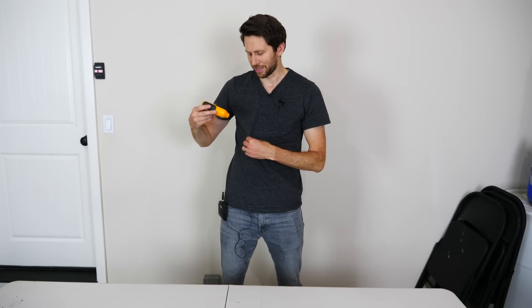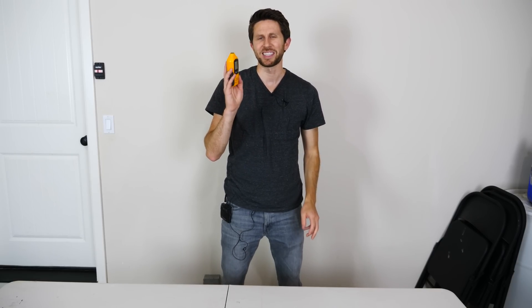Another thing to put your mind at ease — remember we were going to overload when I was using Siri? Let me show you something else that puts the microwave leak detector in overload. So all I'm doing is waving my shirt here and it's going into overload — over 10 milliwatts per centimeter squared. Where are those microwaves coming from? By waving my shirt I have a little static electricity on it, and those tiny micro sparks give off different frequencies of radiation that the leak detector picks up. So if you're not scared of somebody waving their shirt by you, you shouldn't be scared of using your phone.